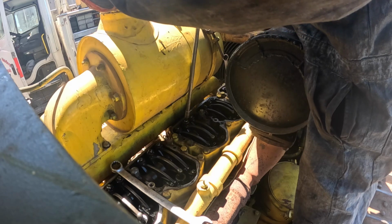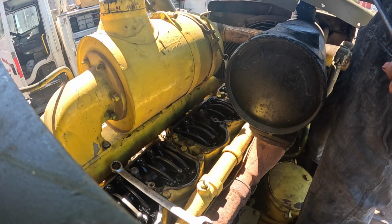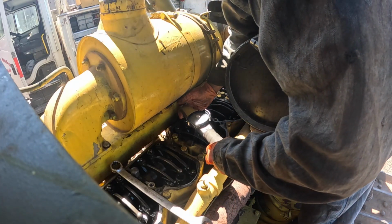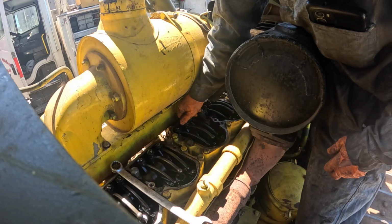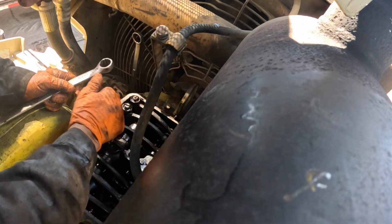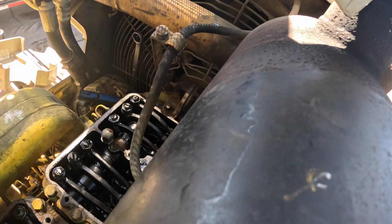Okay, let's go. Okay, kind of curious. Yeah, it's the same. Doesn't matter. Okay, let's get this one loose. I just don't want to, the injectors just got rebuilt. If they're too tight, you have increased wear on your cam lobes and your cam followers. I could probably do that one without an extension, but I'm going to back it off. Regular screwdriver.